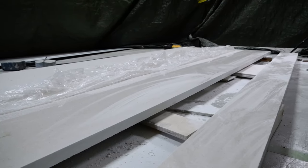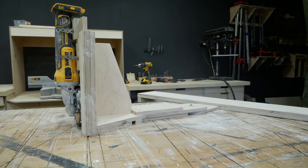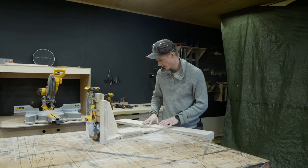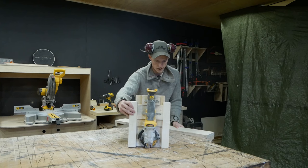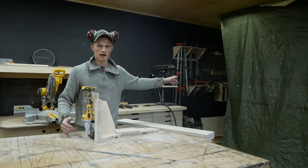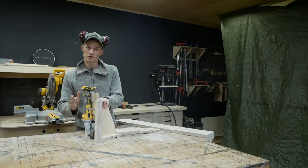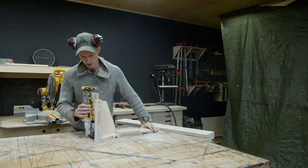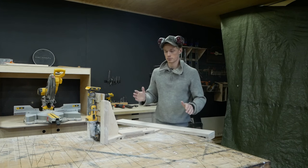That went very well, but now we are moving on to the semicircle. I want to present my latest jig: the first edition of the Baloney Granite Circle Blaster 3000, patent pending. It's based off the old jig with added parts at the back — one part secures to the countertop and the rest can be swiveled around to hopefully leave a perfect semicircle. I have to drive the blade all the way through at each position, then move it a little bit, rather than trying to arc continuously, because if I do that the blade will bend and maybe break.